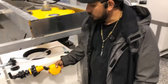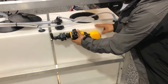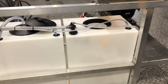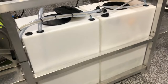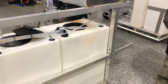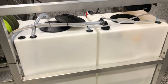Another thing about mounting on the side is that you're going to lose a lot of usable water, because you have to position the bulkhead so low for the float to be able to rise without hitting the top of the tank. That's why every time we can, we try to do it at the top. In some cases, depending on the variables of the rig install, we have to do it on the side. You could also install the float valve in a tank lid, though we haven't actually done that ourselves.